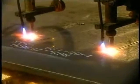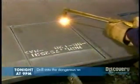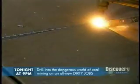It all starts with sheets of solid steel, up to 1.5 inches thick, and an automated machine with an oxygen and gas-fueled flame. The flame slowly cuts the plates that will form the walls of the safe. The cutting creates gases that are doused with water. A welder with a manual version of the same flame frees up the plates with a few last cuts.